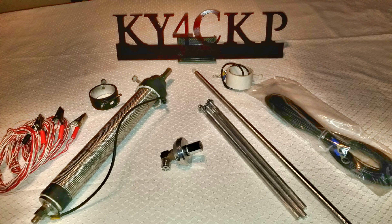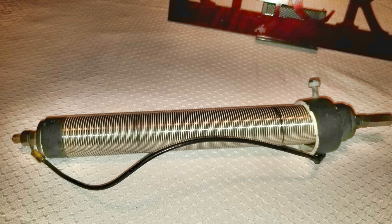I'm also upgrading a couple of components. One of the things that Wolf River Coils did was design a new set of pickups — we'll see what one of the pickups looks like in a minute. They're inside those collars that you slide up and down the main coil. They designed a wider piece of metal that's curved to better match the curvature of the coils, so you should get a stronger contact, which will help keep the SWR down and give you a cleaner contact.